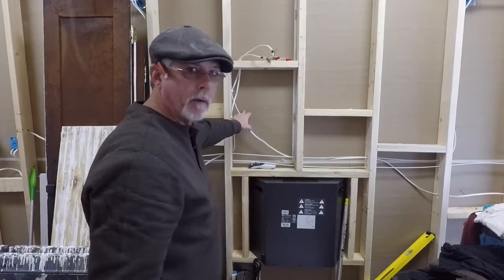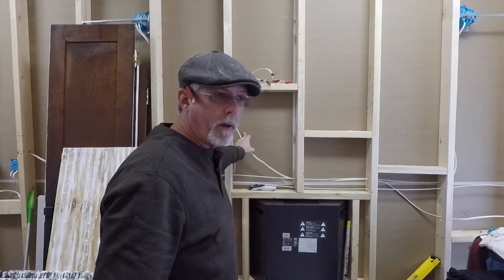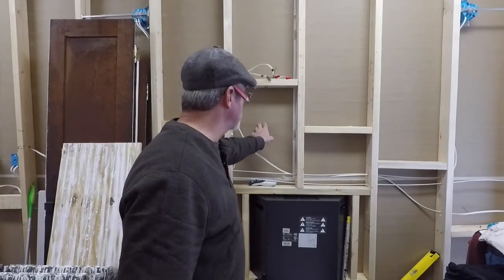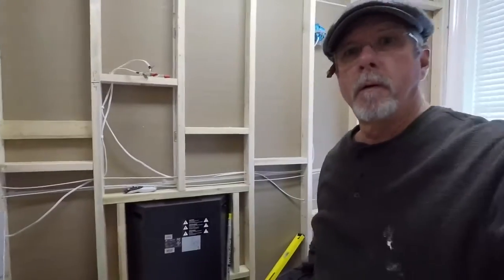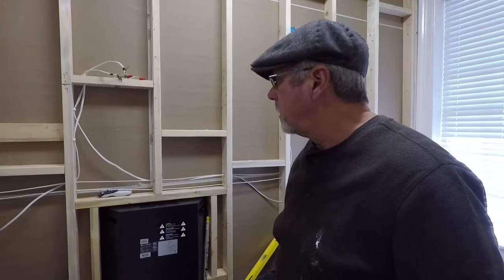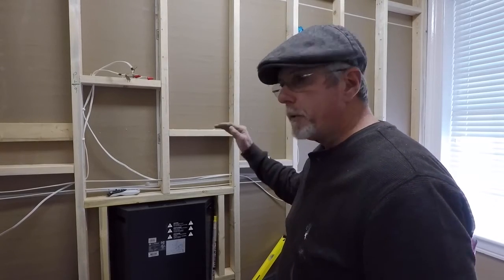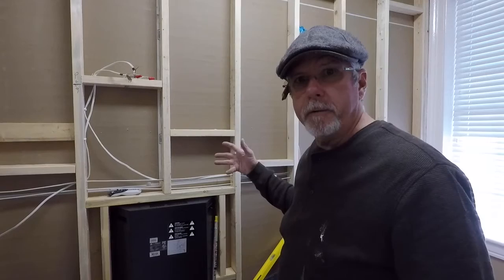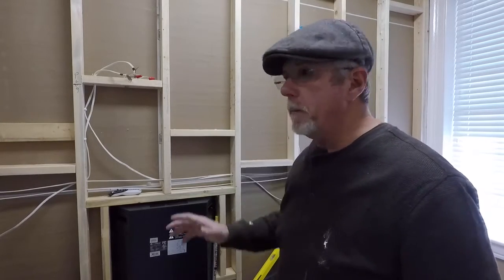Let me show you on the backside. I've already put one in and I went ahead on that piece that the mantel is going to hang on. It already has a pre-drilled hole and I had to drill a few holes to get them in the right spot, to get them on a brace to hold them — I had my wife come in to help me hold it. I'm going to cut some braces to go across here, and then right over here, to put a brace across there so we get plenty of screws in it. There's probably not anything going to really sit on top of it — we're not going to sit the TV on top of it. I just want to have it really secure so it doesn't come loose or fall off. Probably just decorative stuff my wife puts up there.